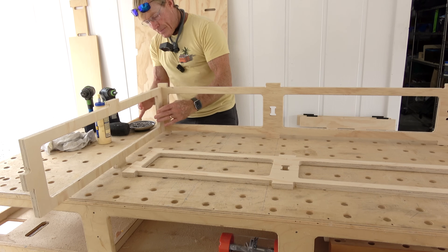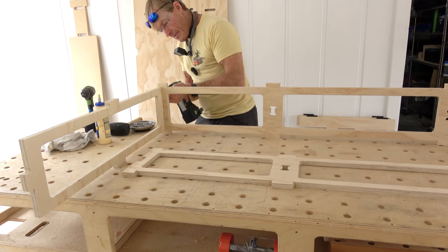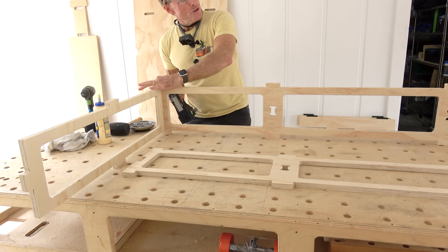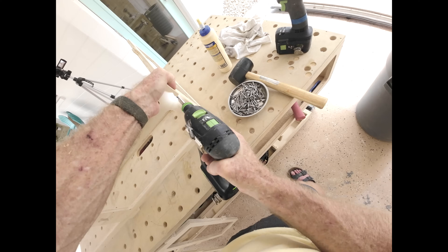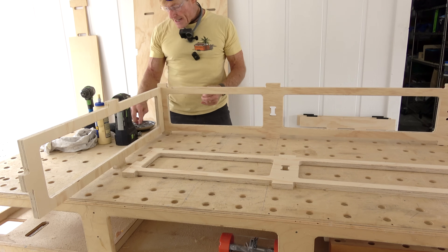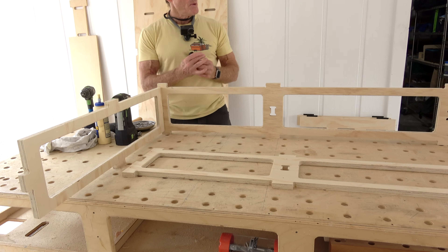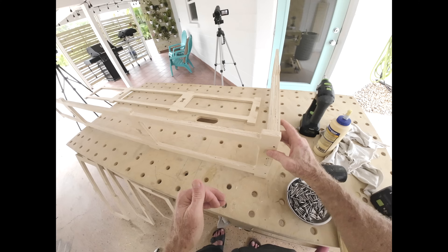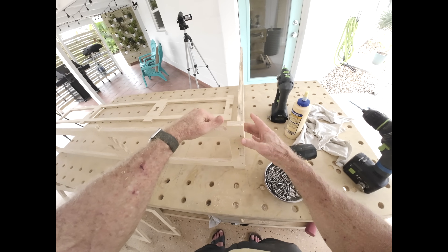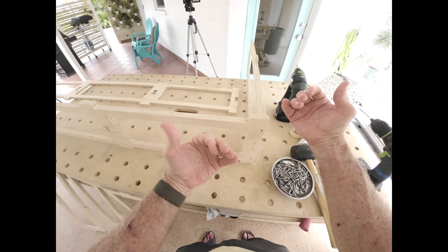If you want to use clamps you could, but I'm going to start without clamps and see as I progress if I want to switch. I'm making sure to use my finger to feel that it's flush to the outside. I'm not countersinking for these — they have a very small trim head and will sink right in, so you can overdrive them. I'd like to keep them close to flush. Since this is a soft wood, the screws will drive in deep, so it's a good idea to pull your joint together tight and then just set the screw into it.